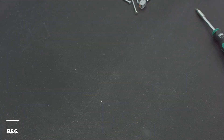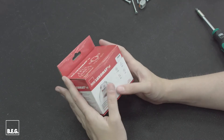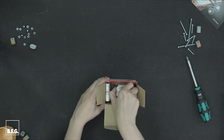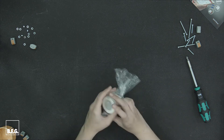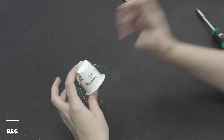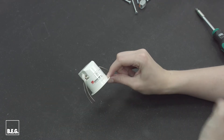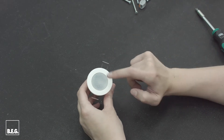First we put the box aside and start with the PD-11 DALI-Link. With its super flat appearance, the PD-11 occupancy detector is the first choice when it comes to design. The very low installation height of only 8mm is outstanding. Despite the flat lens, it offers a large detection range of up to 9 meters in diameter, which is perfectly sufficient for most applications.